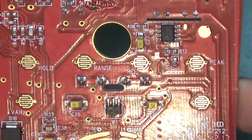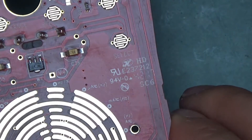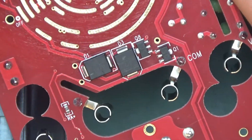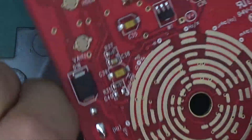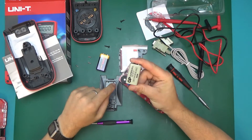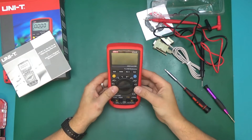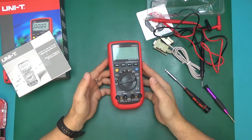Worryingly, I do not see any diodes on the terminals of the battery. The board was produced in the 42nd week of 2017. S3G — those are rectifier diodes, and there are a few more on the other side as well. I've got a different battery to put back in, so let's put it back together and start using it. Having seen what it's made of and what components are inside, that gives me very high confidence in the quality of the measurements of this meter.